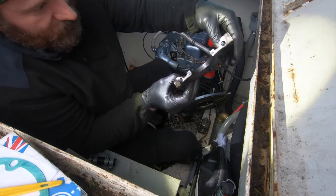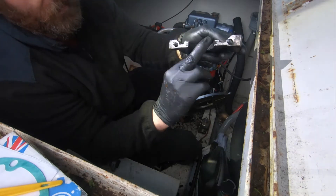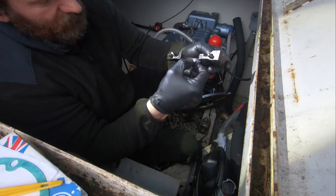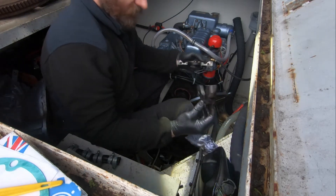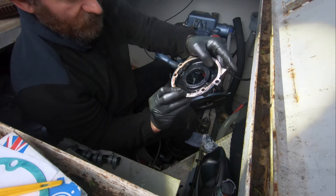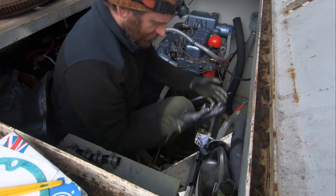As you can see here, that's all it is — it's like a carrier, two halves. Packing goes in here and it's as hard as metal, so it's well overdue being done. Two halves, two mating halves that go together; the packing is squished and gets squashed against the crank, but it's not working anymore.